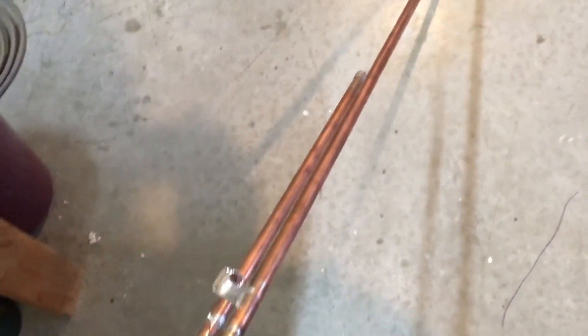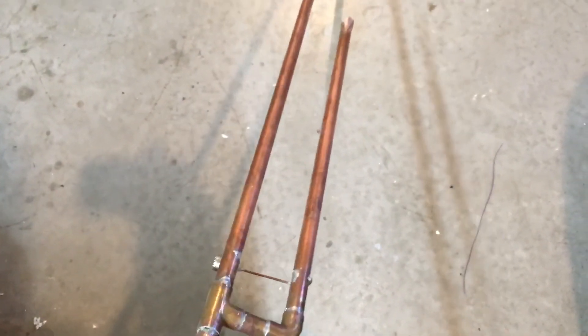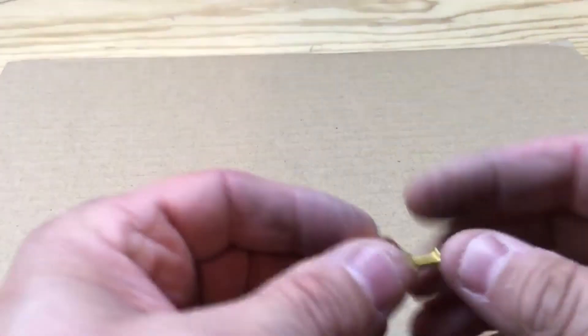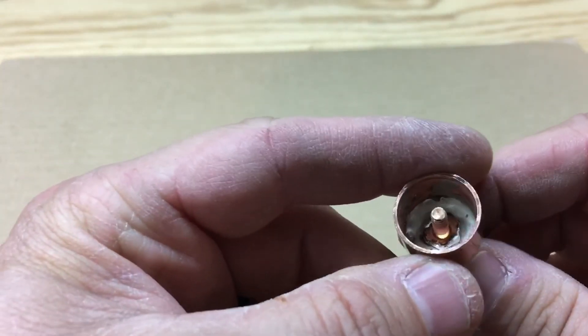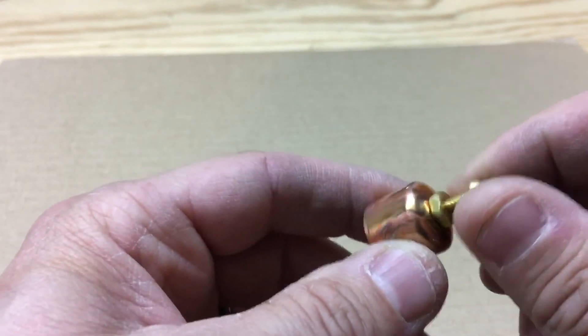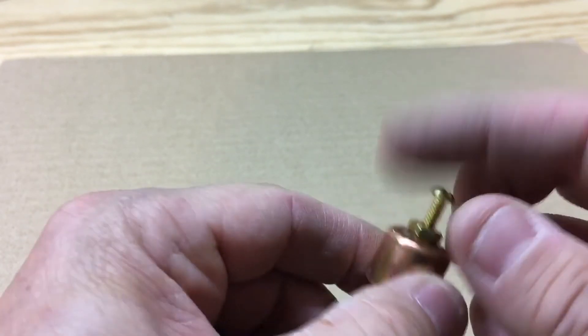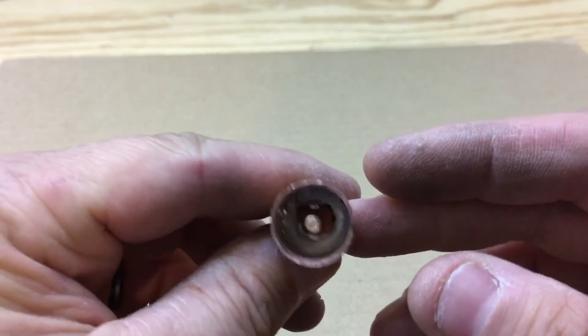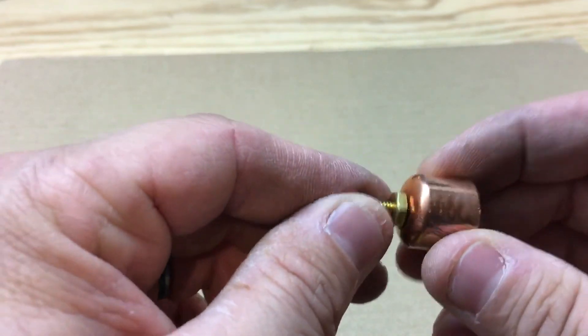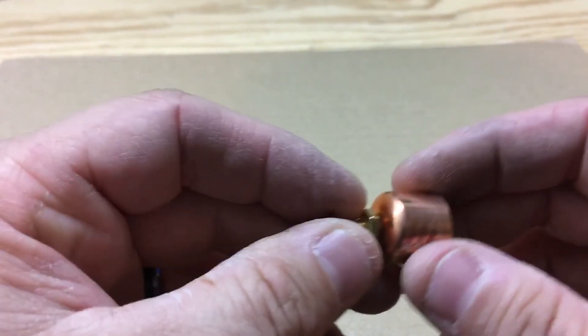Just be careful soldering and hopefully it might work out for you. I made two J-poles with this and it seems to be okay. Quick overall: this is a 6-32 one-inch brass screw with 6-32 nuts — you need two nuts and a screw. No washers needed. It's a half-inch cap you can get at your local hardware store. Be careful — hot stuff. Thanks for watching.